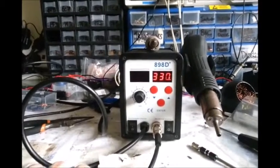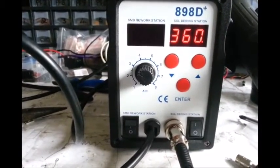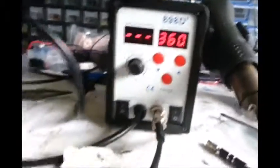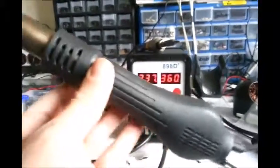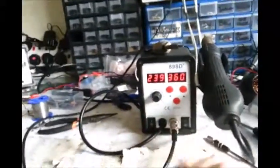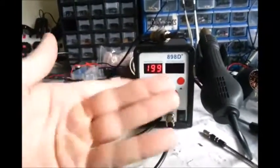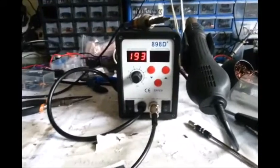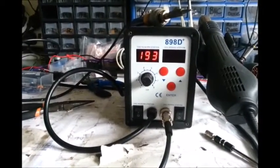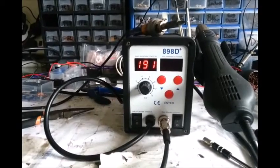All in all, the repair costs were one pound 15 for 10 triacs — please forgive the mess. Well, I'm well chuffed. We now have got a solder iron that works, and it was nice just to hear — you can hear a slight hum from the transformer — nice to hear it hum and doing exactly what it used to do. Both sides are working. I can actually switch one off and it will still warm itself down. I think that's it for this — it's been a successful fix, and I'm happy with that. Now I've got another spare solder station in case the other one goes down. Brilliant, thanks for watching.